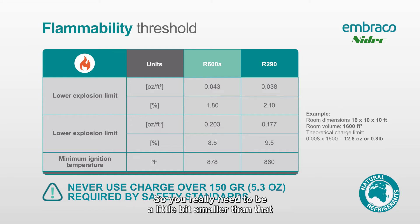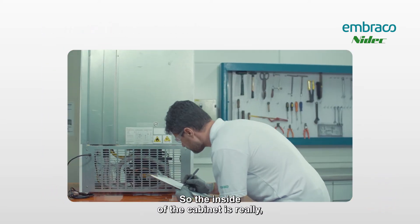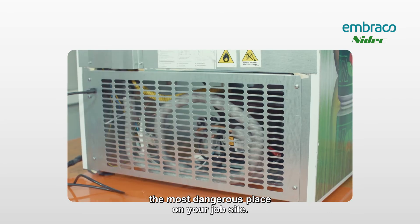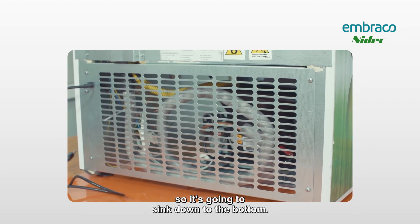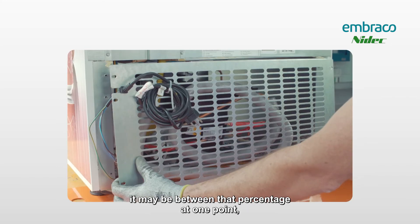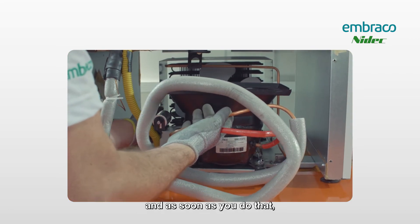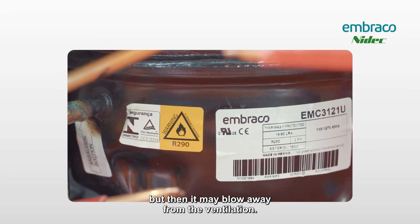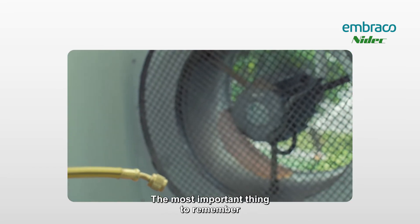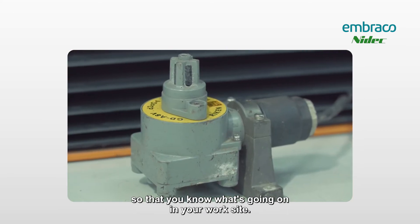You really need to be in a space a little bit smaller than 5 by 5 by 6 feet to have the potential for a flammable atmosphere — which is roughly the size of the inside of your cabinet. So the inside of the cabinet is really, at least potentially, the most dangerous place on your job site. Remember, R290 is heavier than air, so it's going to sink to the bottom. If you have a leak inside the cabinet, the concentration may fluctuate — opening the door may put you in that flammable range, but then ventilation may blow it away. The most important thing is to always have ventilation and to always use your hydrocarbon gas detector.